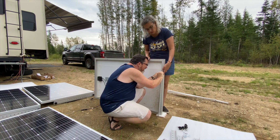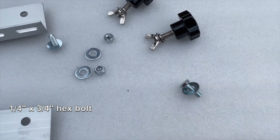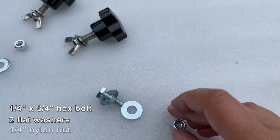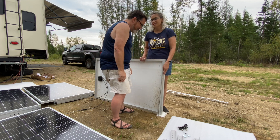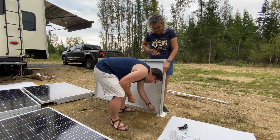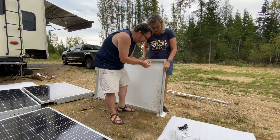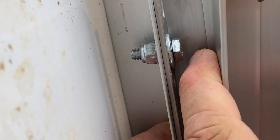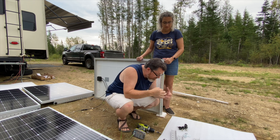We've got one-quarter by three-quarter inch hex head bolts, two flat washers — one for either side of the material it's holding together — and a nylon lock nut to go on the inside. The mosquitoes are coming out; this is our last one for the day. These nylon nuts have a nylon disc in there that helps grab and hold tight so it won't back off.